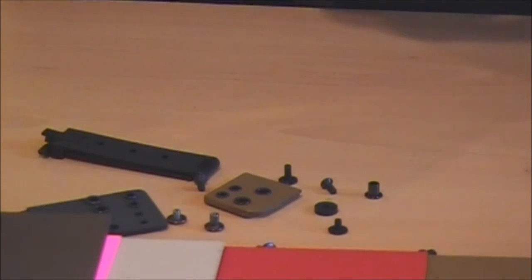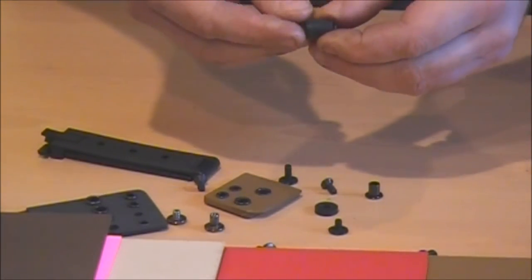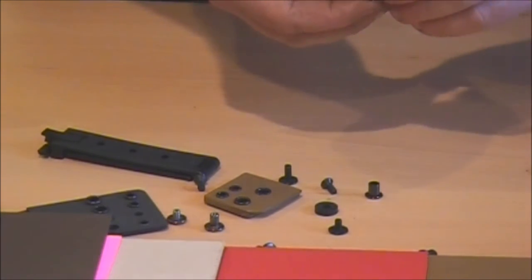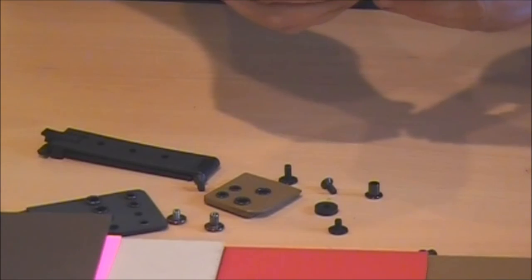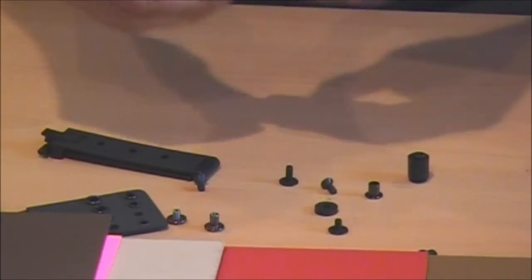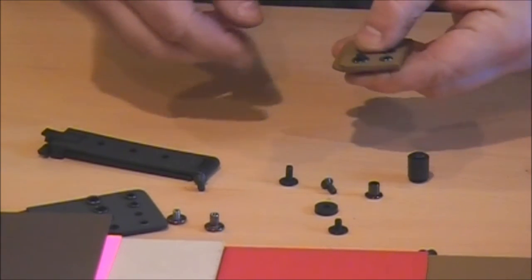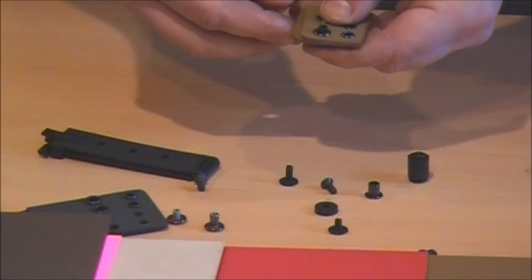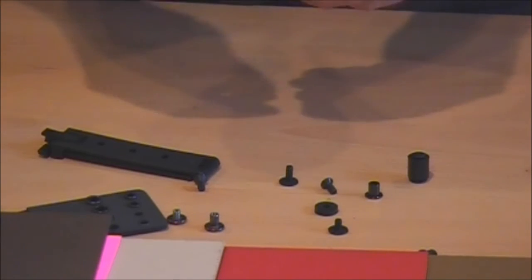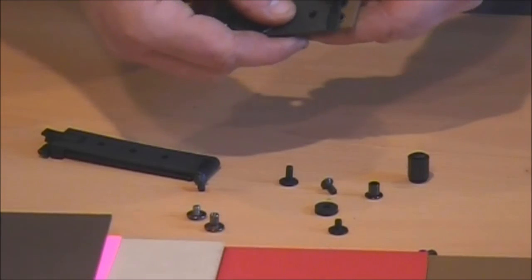As I say, there's a wide range. This is another version. This is an extra long, this one's 1/2 inch. It's a post rivet and a very large spacer. Again, having them gives you options for bolting different things together. It's slightly longer than this one, and it depends on how many bits you're going to bolt together or not. As I say, you don't always have to put a rivet in. In general, if I'm putting a fire steel loop on, I won't actually rivet the holes because there's no need. We can just use plastic straight through and clamp it in between.